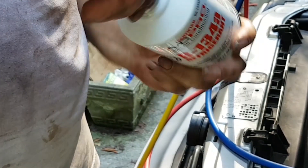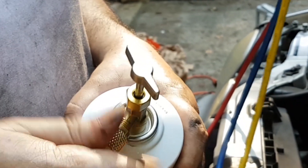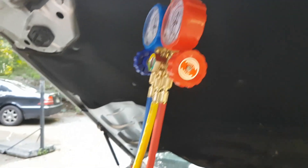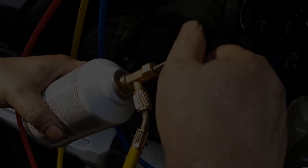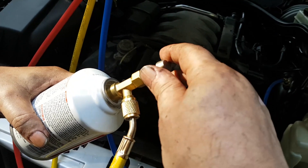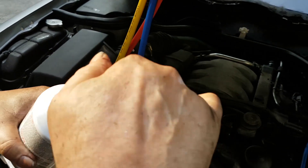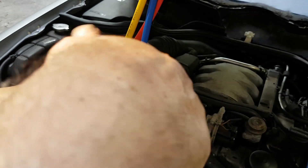The gauge referenced in the description comes with a can tap. You turn the knob on the tap — that pierces the can — then wait to hear a hissing sound, which means Freon is making it out of the can into the yellow line. Back it off a little bit so Freon flows from the yellow line all the way into the gauge, though there may still be some air in the yellow line.